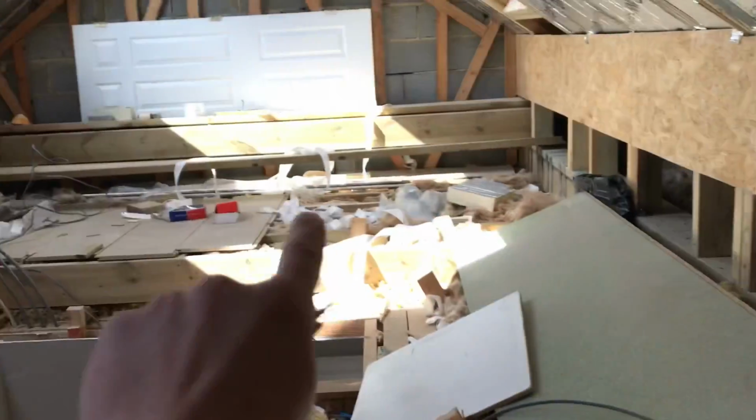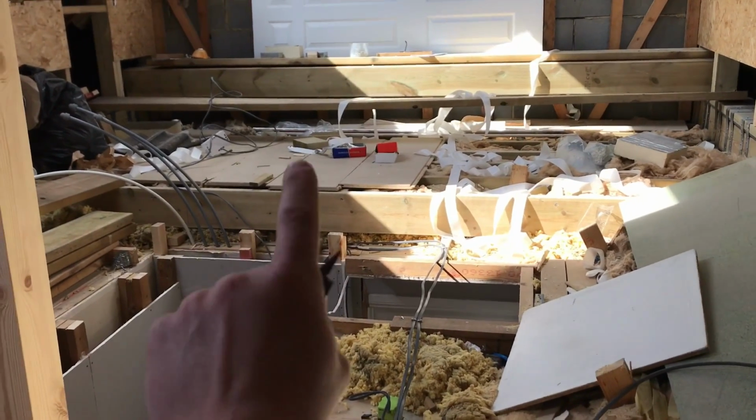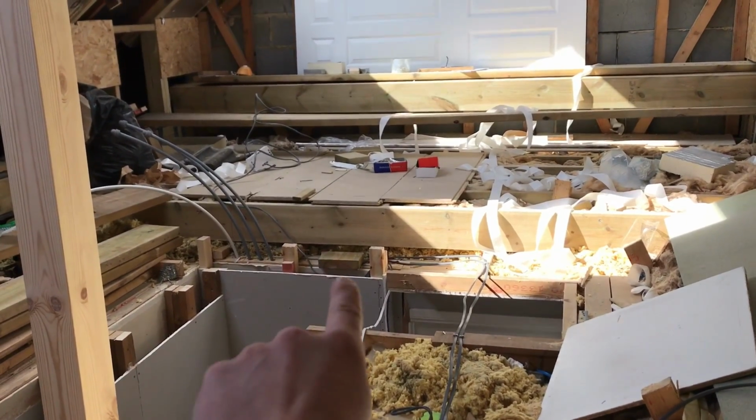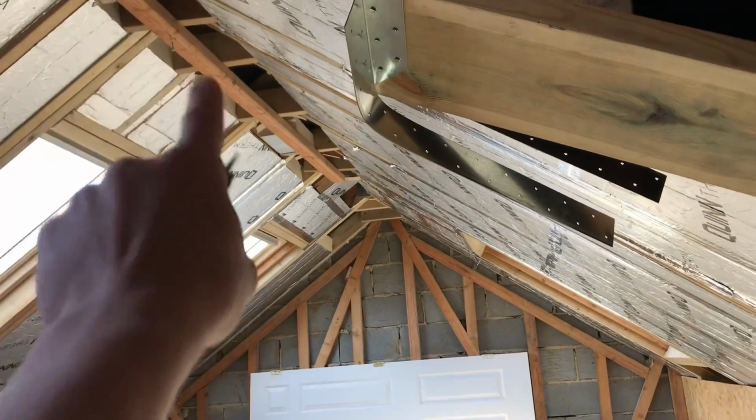And then I'm going to take a feed off the bedroom light in there to feed this switch, and then I'll take a 2-core from my switch up to my new lighting points along here, and then remove that bit of timber as well today.